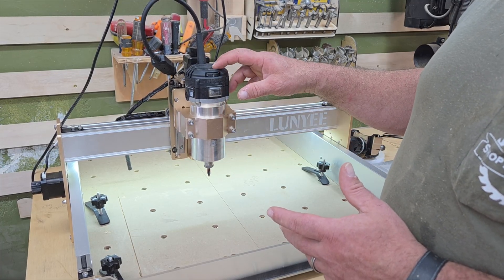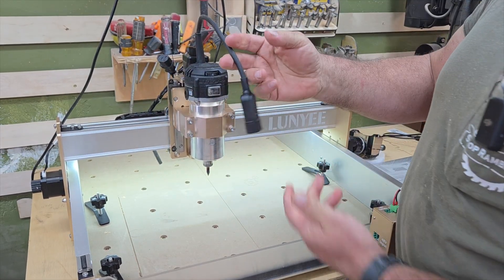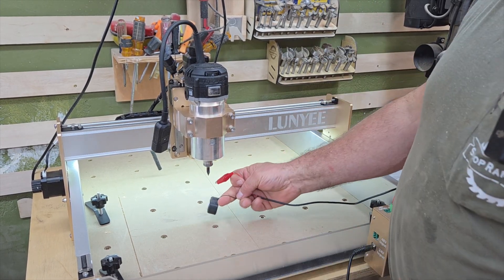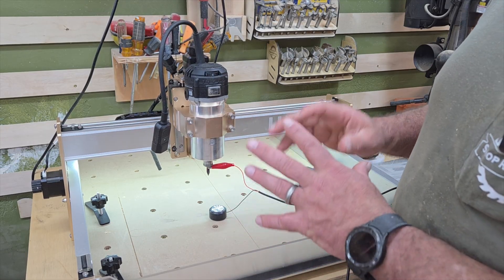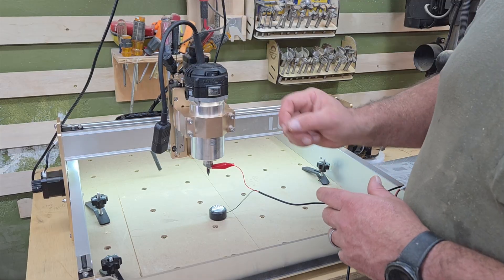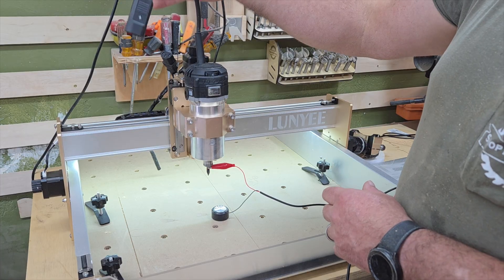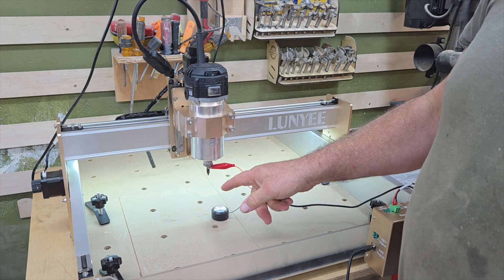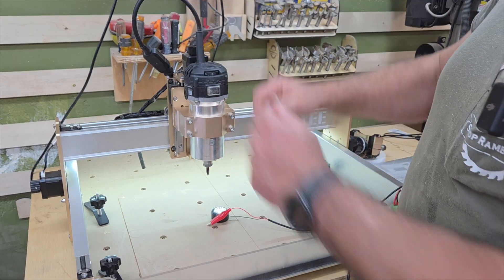This particular router — I'll put a link in the description — was about $100. One of the cool things about it is it's got a plug right here. Another great thing about this machine is that it comes with the Z-height probe, and you have to connect it on and then it goes down and touches. Like with 3D printers, that's one of the hardest things — getting that Z-height set perfect. When it touches it makes an arc, but with it being connected and plugged in, it's picking up the ground so it throws an error code. So you have to unplug it while you're doing your Z-height. With a plug right there, I'm able to pop that off, do my Z-height, and plug it back in real quick.